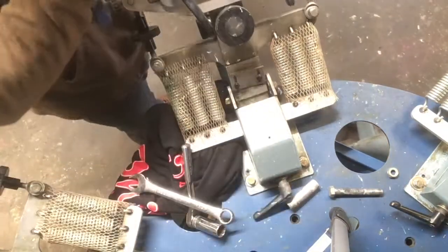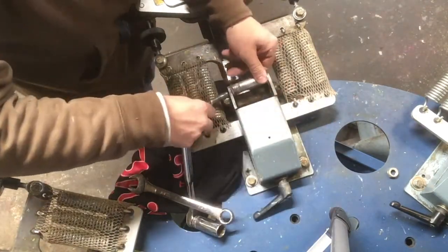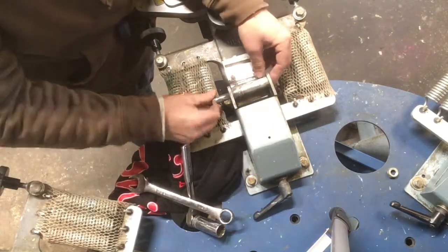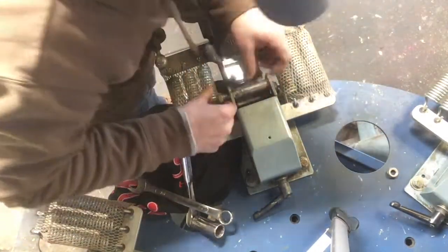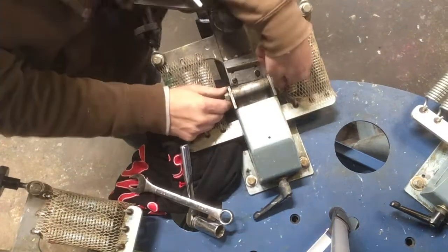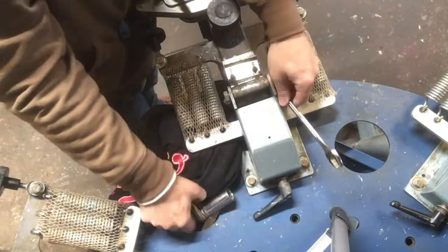Tension is still off back here. Pull it down, there's the true test. Bolt goes in there first. Spacer goes in between. It's kind of what it runs through and makes it so the head hits that instead of just directly against the bolt. Lock nut goes back on. And we're just going to tighten that back up the opposite of how we just took it off.